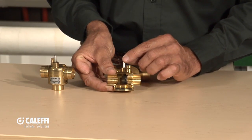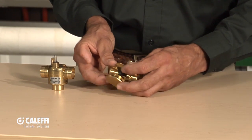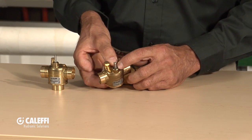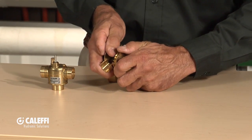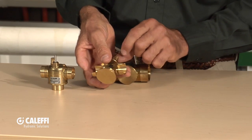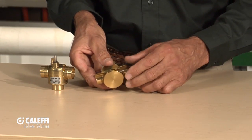The stem is a stainless steel stem, not a plated brass stem. So if the stem wears in there, you're not going to wear the plating off and have a leak. We put a double O-ring on our stem and a snap ring on it. The snap ring is there because you can replace that stem. We can take the bottom of this valve off — it's got a fine threaded plug with an O-ring — and that's what allows us to get in there and replace that stem if needed. You take the snap ring off the top, drop it out, and you can replace the stem and the flapper. We offer that as a repair kit.